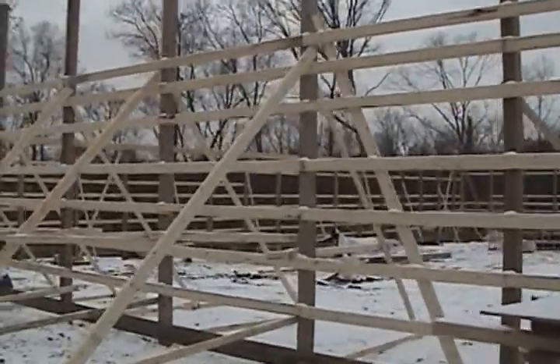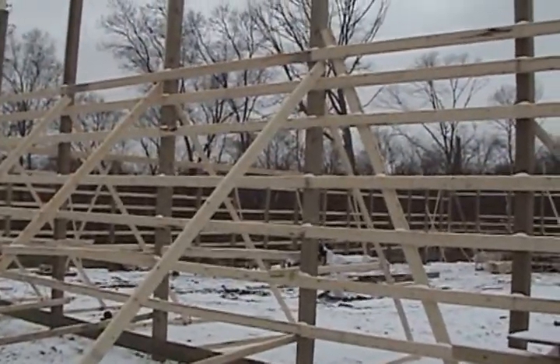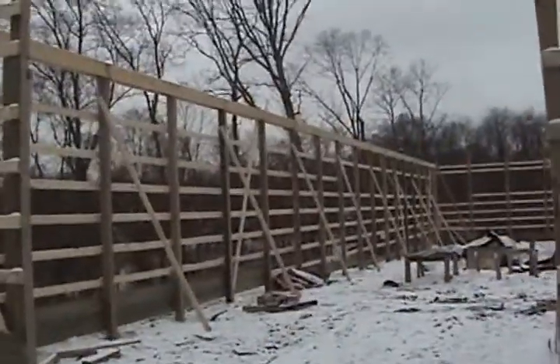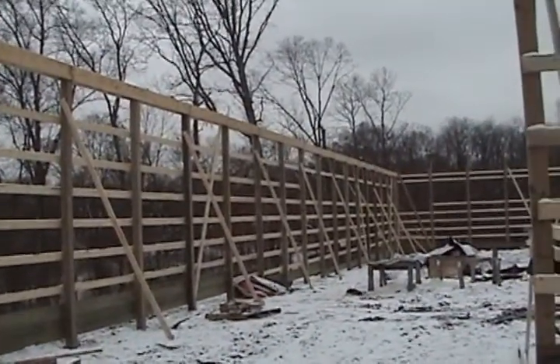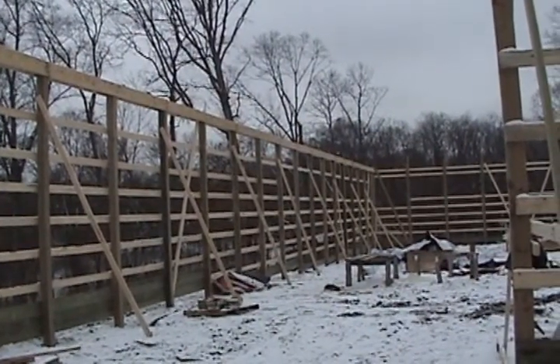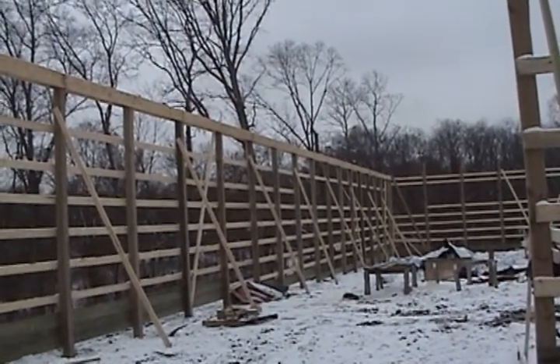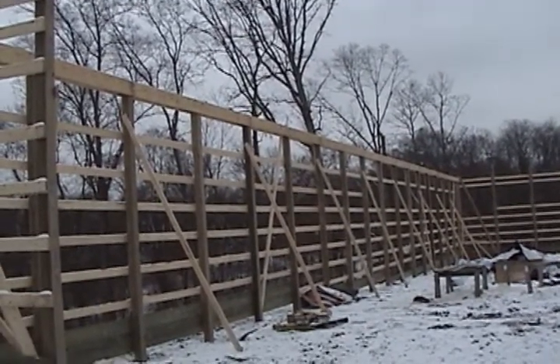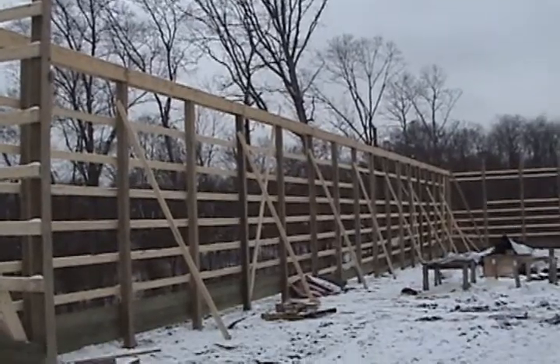On the other wall we only have a brace every 16 feet, and what we'll do is pull that wall in and out and nail it at the edge. This bearing wall — we just put a brace every 16 feet to take the shake out of it for the guy up there. We'll pull the wall in and out with the truss, even it up and nail it off since we know the other wall is perfectly straight.